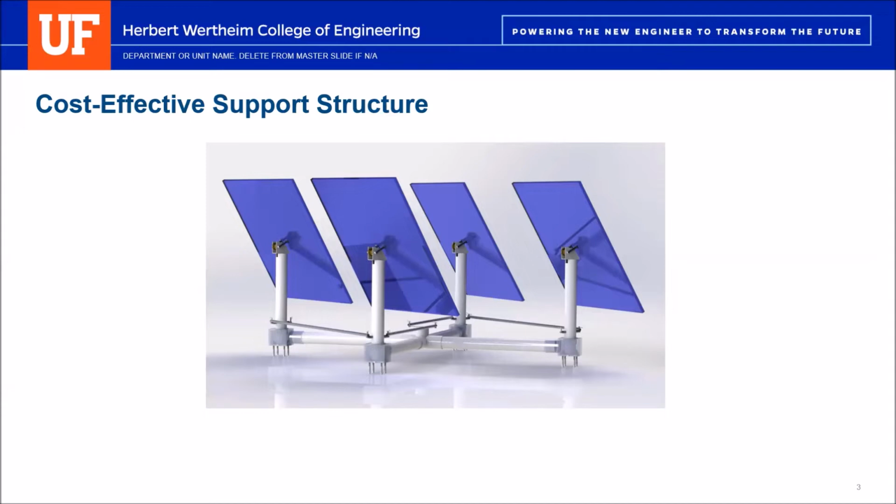Composed primarily of cost-effective standard-sized PVC, the structure provides the necessary support required for the heliostats even in Nevada desert conditions. The PVC makes an X shape, further implanted into the cement floor via 3D-printed plastic bases to provide rigidity.